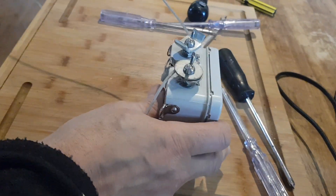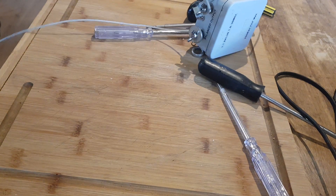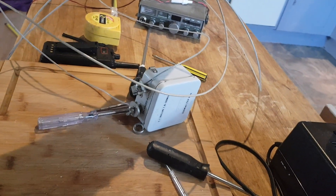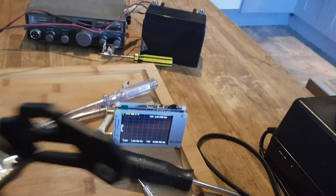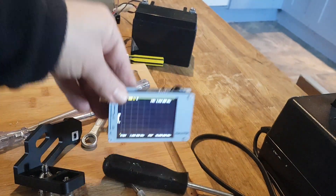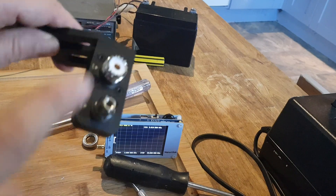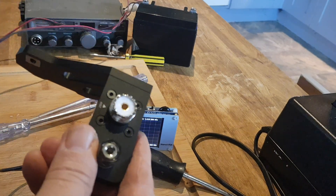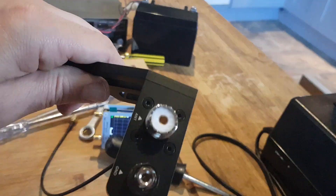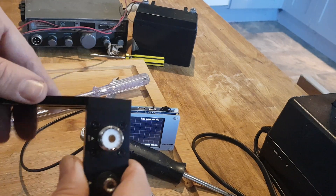So we're going to go and hang it from a tree now. I've got an antenna analyzer — let's see what it says. We've got an adapter for our network analyzer. We're going to calibrate this for 27 megahertz. Our patch lead would go from here to the radio, and then the analyzer will go here. The antenna will go here and we'll plug it in there — we'll have a patch lead between here and the antenna we just made.